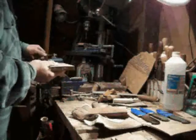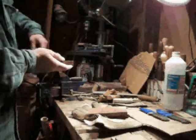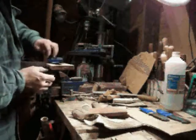Alright, so now that I'm done wrapping the blades to protect them, next step is to work on the handles a little bit, or the tangs, so that they'll accept the handles. So I'm going to take them and put them back in this vise. If you remember from the other piece, this is the setup that I used to hand sand the knife. I'm going to just grab it down. I don't need to grab it hard, I just don't want it to go away on me.